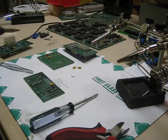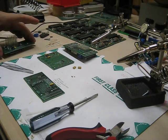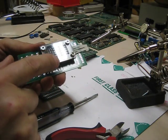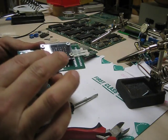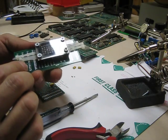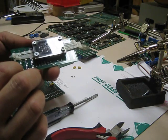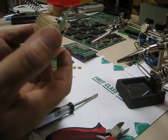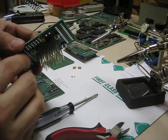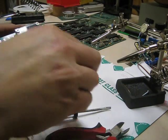As far as putting the LEDs in, that's a real pain. The real trick — the LEDs need to be exactly the same space away from the PC board. Because normally when you shake it, the LEDs will fall up and down and won't stay exactly where you need them to be. I found these little zip ties that seem to work pretty well.